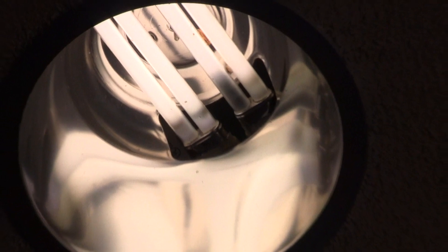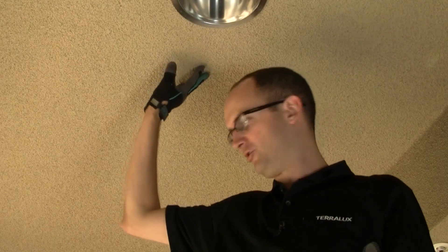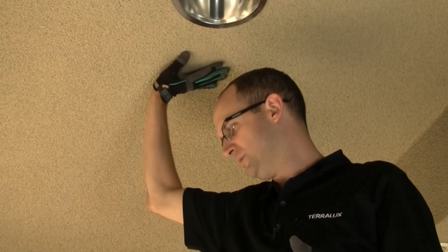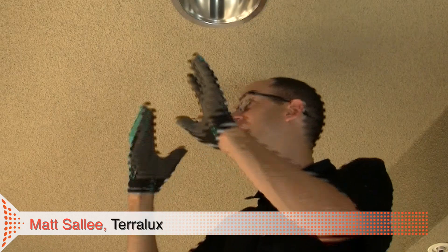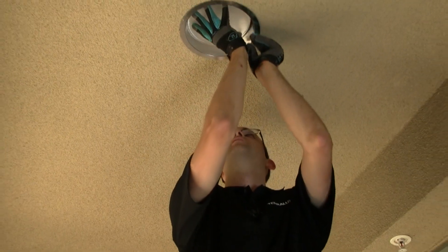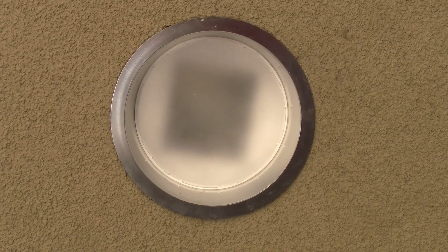In terms of the existing CFL infrastructure, like the pin base, do we just leave that in or can we take it out? In this retrofit, we've left the lamp holders and the existing ballast in the ceiling. It's up to you as an installer and as a building what you'd like to do. You can remove them and take them out, but you can also speed up installation by simply leaving them in the ceiling. They're no longer connected electrically and they're just out of everyone's way, so it doesn't really matter. The final step is to snap on this diffuser. This will keep the LEDs from being too sharp or blinding, and it just snaps using these clips directly onto the engine we just installed, creating a nice seamless finished look on the inside of the reflector trim. And that's all — we'll turn the power back on and we'll have long-lasting LED light.